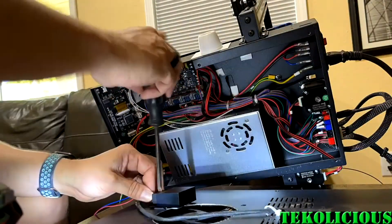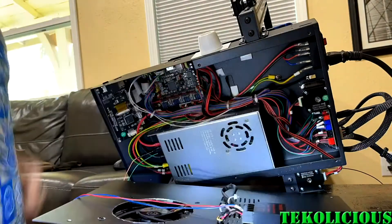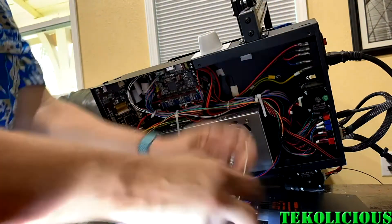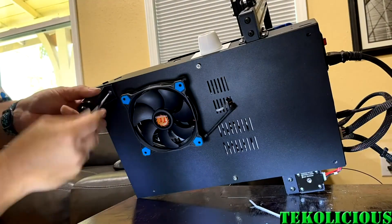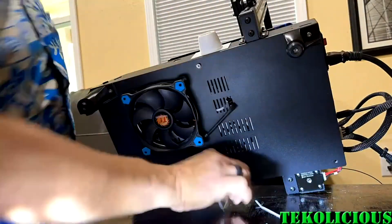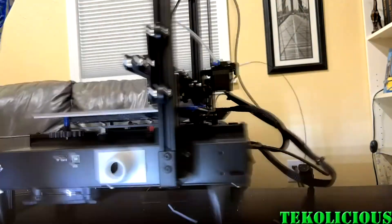So here I am, basically tying in that board I got off Amazon. I'm going to stick it in there and turn on the fan. It powered up so I knew it was going to work. I proceeded to close up everything and zip-tie everything, because now I had it wired right. I should have done this from the get-go. The Chinese boards inside 3D printers are, let's say, crap when it comes to certain things. They get the job done and they're pretty cheap boards — $50, $60 — but you would think they would have some kind of short protection, some kind of voltage protection, to keep it from blowing out your output. I hooked up a 12-volt device and it blew out my 24-volt output on my board.